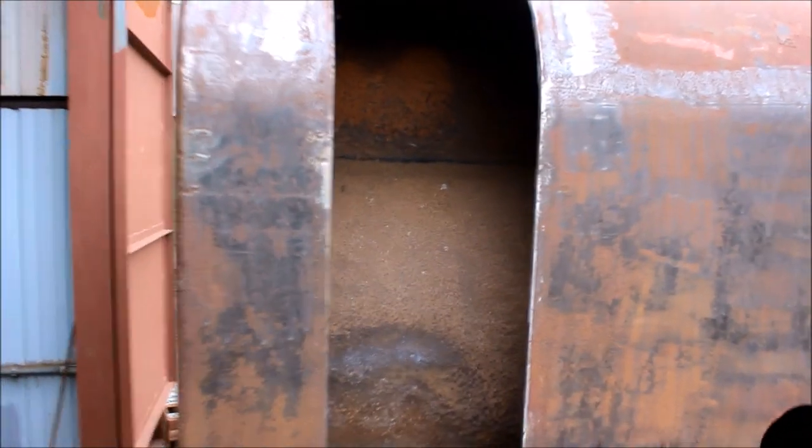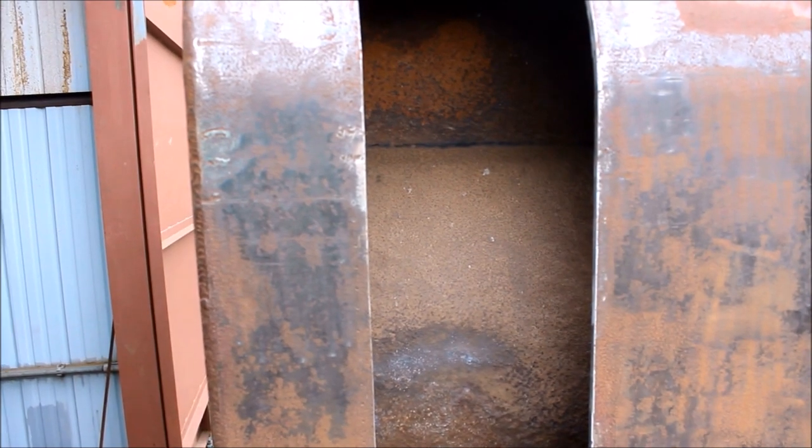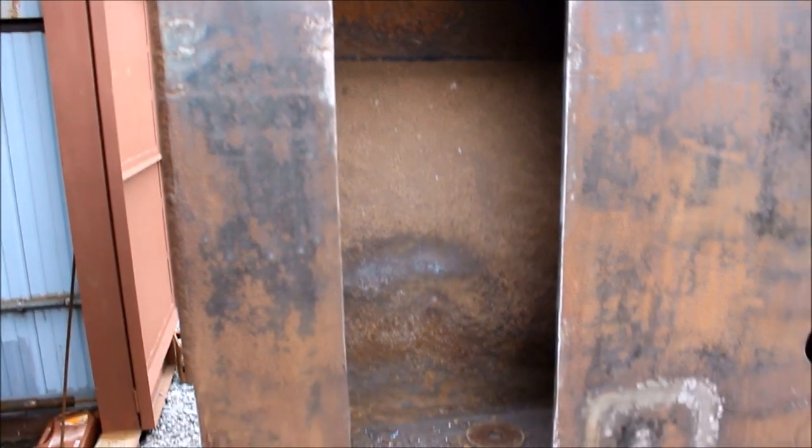We have the tank outside here to show what we've been doing. I'm cutting out these pockets for the sandboxes, and those will be replaced with 3/8 inch plate. It really is the only way to get access to this back corner, and with them out I can get in here with the sandblaster and sandblast the interior. If I pull all four of these off, I can get unobstructed access to just about everywhere in this tank, so I can sandblast, put a coating on the interior, cut new plate, fabricate them, and stick them back in. It'll be relatively easy — just three flat pieces, fit them in place, weld all around, and it's done.